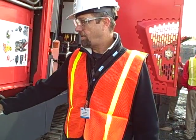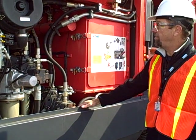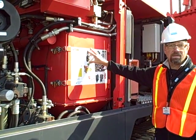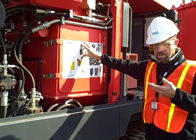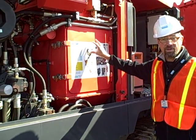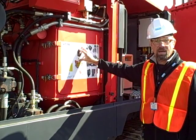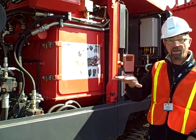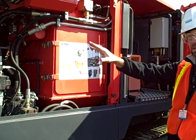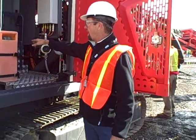Making our way around to the other side, we have an Enduro 25 air compressor with axial piston pumps, your compressor filter here, and this is your fines collector for the dust collector. As it's sucking up the cuttings, the fines come to the rear of the machine and this will pulsate ten times and then discontinue — it won't continue to pulsate like the old days, which used to cause fugitive dust flying around.